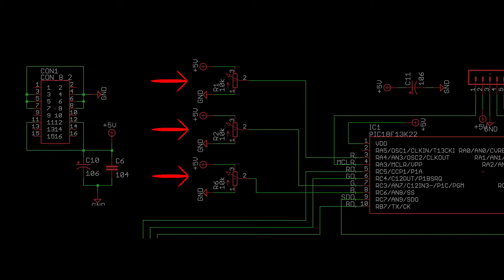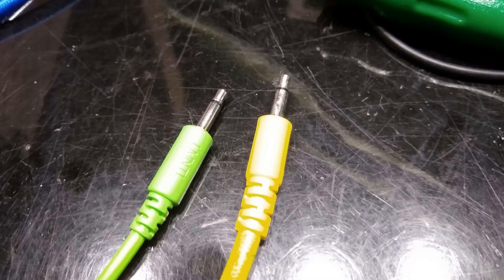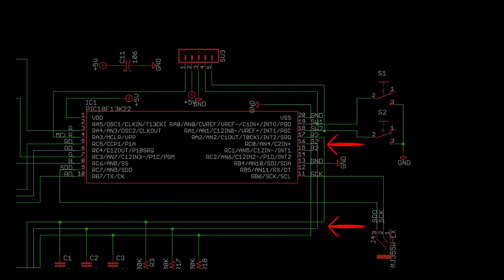Brightness of the LEDs are controlled by these potentiometers here — one for each of the R, G, and B channels. The three jacks here are used to connect analog signals to the module and override the potentiometers for light brightness. I use stereo jacks here so that I can use the ring on the jack to detect when a patch cable is inserted. Patch cables only have a signal at the tip and ground out the ring on a stereo jack connection. This can be detected by the microcontroller. The analog signals then pass through an op amp and through this crude rectifier before being read by the microcontroller. This allows for both an AC or positive DC signal to be used as an input.